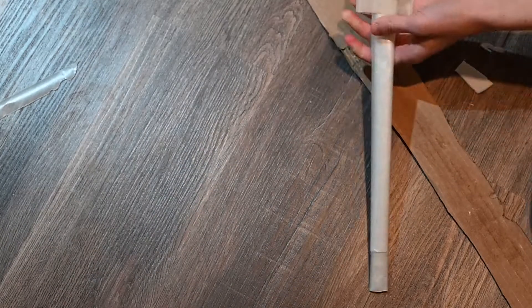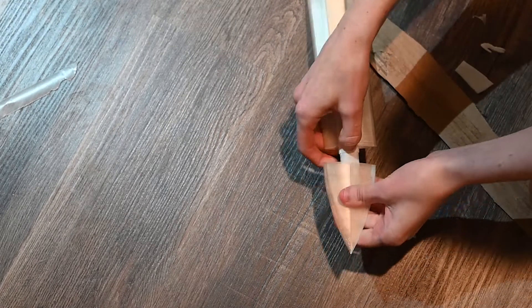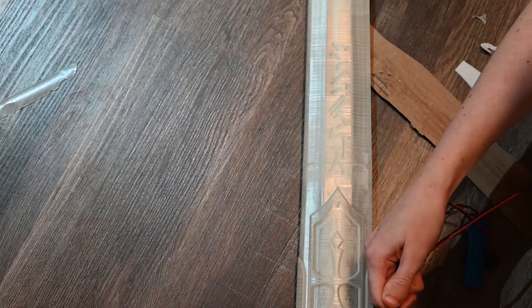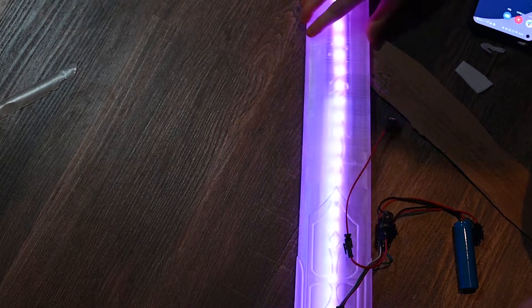Diffusion is really hard to get right in tiny blades. To do proper diffusion you either have to have the LEDs further away, pointing away from where the source is, or have more LEDs in the strip. More LEDs is hard to achieve because you would need a bigger battery source. And don't forget — always make sure to check your LEDs before you add them to the sword.